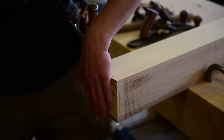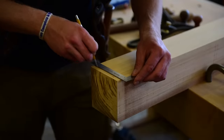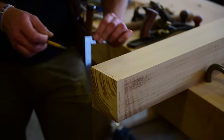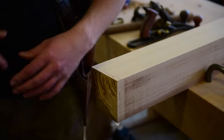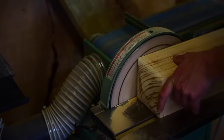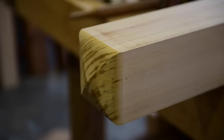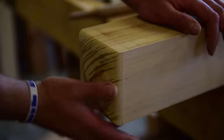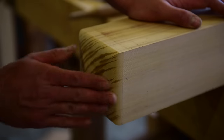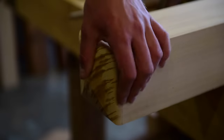So I've got my faceted top here. I'm going to make half an inch back, square another line down all the way around. This is just a reference line, and then I'm going to round over these edges — take off that real sharp look. The disc sander does a bit of a rough job, and then I'm going to smooth it out with my palm sander. You can see all the tannins in the cedar here that hold a lot of moisture — that's just weeping out the end grain. Once the post dries, those will all blend in. The color will just be uniform throughout once that moisture gets drawn out and dried up in the sun.